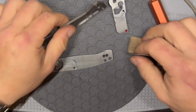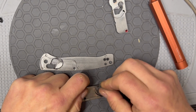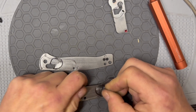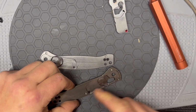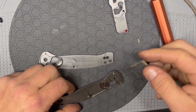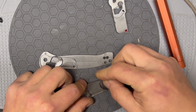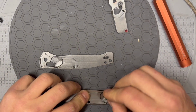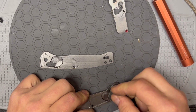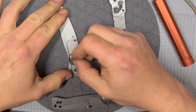While they were milling all these pockets out, it's already set up on the CNC machine, it's an automatic tool change, or maybe even not needed. Like you could set up your milling program to increase the rotation speed and decrease the feed, and then you can actually get almost a mirror polish with nearly invisible machining marks, and that would lead you to avoiding a little bit of embarrassment when the knife is assembled. There'll be no Ukrainian dude on YouTube moaning about it.